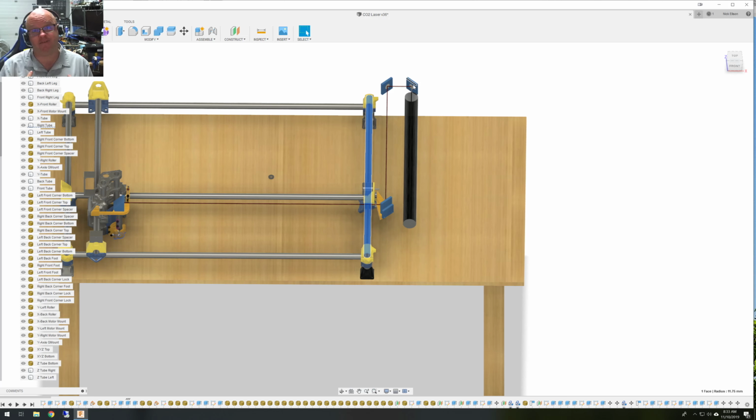So what I did is I could live move the gantry back and forth, and I could watch where it moved. And so if it starts to crawl up, then you know that your beam is actually aimed down at the mirror at a downward angle, and that's going to cause the beam to continue on a downward angle. So you want to correct that. You want it so that when it moves back and forth along this axis, there is no movement up or down or left or right. You need it to hold. It doesn't have to be in the center of the mirror. It could be down on the lower edge or off to the right, as long as you find the point where it doesn't move between full throws. Then you have parallel alignment with this post.